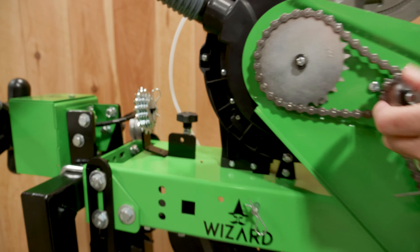I'm going to put this cover back on — again, very simple and very well engineered. Now we're going to look at the vacuum system itself. This is the metering unit I talked about earlier. While it maybe feels a little bit scary, it's really not. The user can very quickly and easily take these springs off — they pop off this plate. This plate comes off; it's got different brushes and things like that, all very well engineered to help you get the singulation you need.